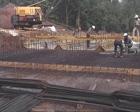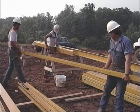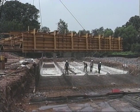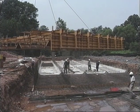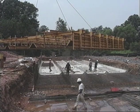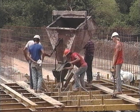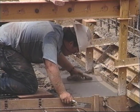From the very beginning, EFCO inverts make your box culvert pours fast and easy. The invert is quickly assembled by a small crew and then lifted into place for the pour. It can be moved as a complete unit and requires no external bracing. With the invert form in place, you're ready to pour the invert. EFCO all-steel face sheets provide you with a smooth, superior concrete finish.